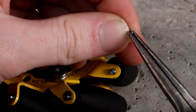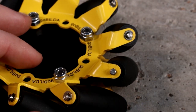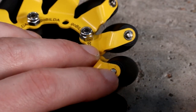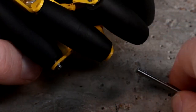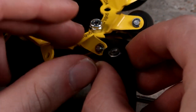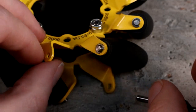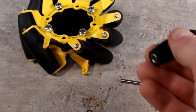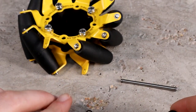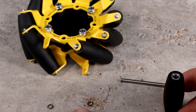We got lucky — it stayed right there so we can get a good look at what that e-clip looks like. After you get the e-clip off, set it aside somewhere you'll know where it is. Now the shaft has nothing constraining it from sliding out, so just slide the shaft all the way out. You can then take the roller out. Look for two shims — the first shim in this case stuck to the bearing, and the other shim stuck to the plate. This is fairly standard when removing the roller, since grease from the bearings causes shims to stick.